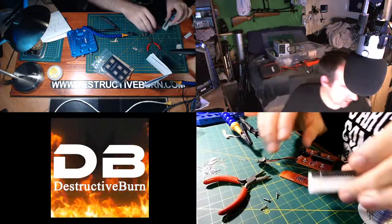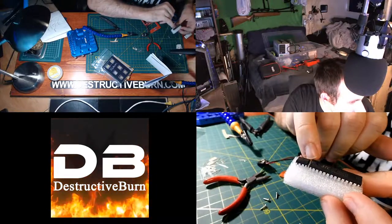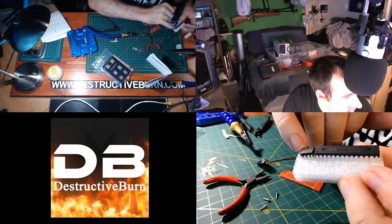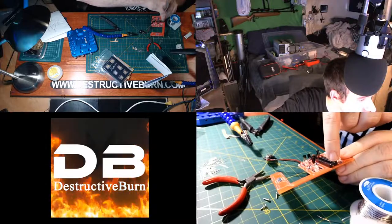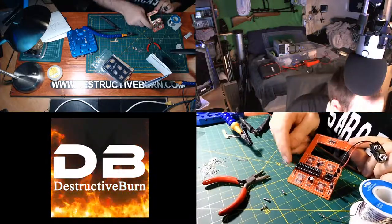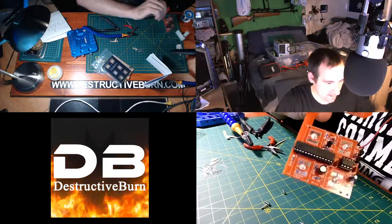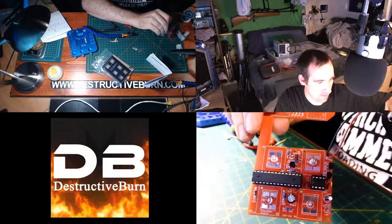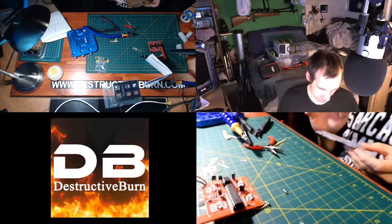Now I can put the chips on. You can see on these chips there is a little curved notch on each one. Those curved notches align with what you did earlier on the IC sockets. If you look at the board upright, your curve goes on one side on both of them. One of the pins is bent so I'll need to do some rework. Just make sure that you put the chips in correctly with the notch aligned.